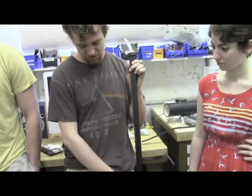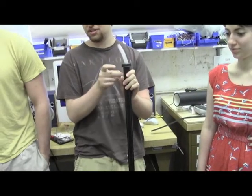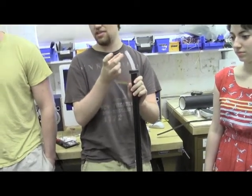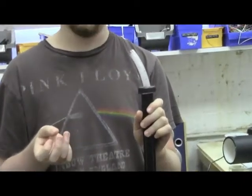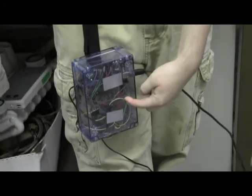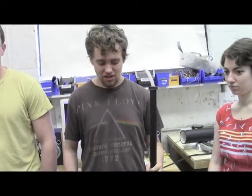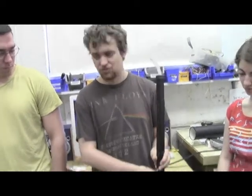Yeah, you've got this ribbon to control pitch continuously. And then you have a breath pressure sensor mounted in here that you control with your breath, and that triggers note-ons and also aftertouch during notes. Then we have an accelerometer mounted in this rat's nest in here. When you tilt it, you trigger sort of ambient accompaniment to the sound. The amount that you tilt it controls the rate of the rhythmic aspect of that ambient sound. Oh, and the button, so that controls the patches.